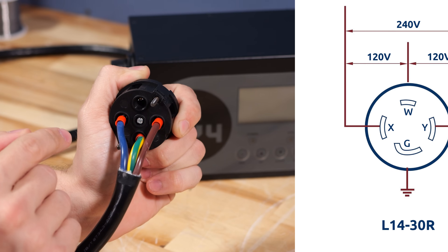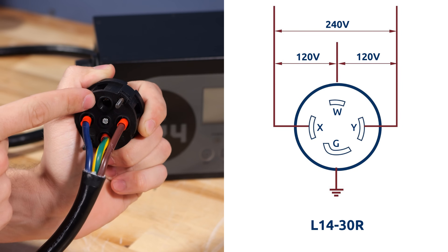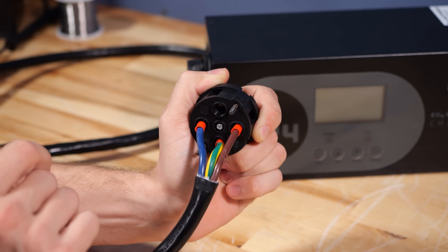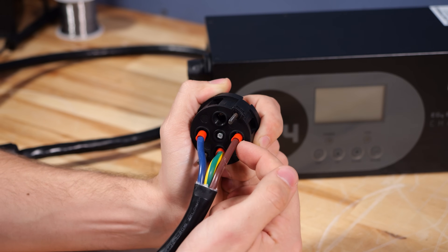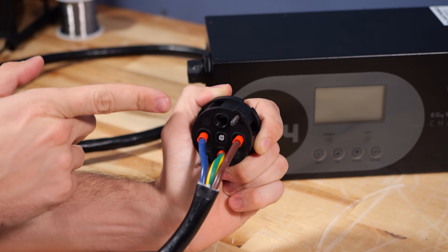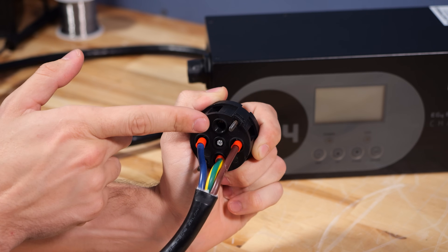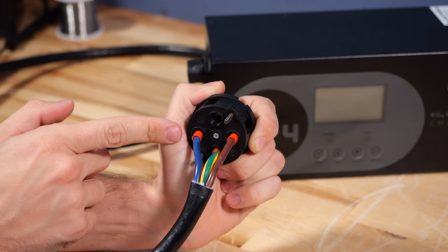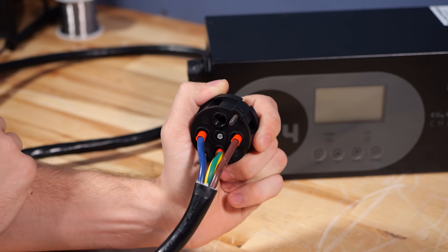When L14-30 outlets are normally used, this would be L1, this would be L2, you'd have your neutral at the top and ground at the bottom. However, this charger doesn't need a neutral — it only connects across two wires. So with the 120-volt cord, it's essentially putting neutral and L1 across those same two pins. This is why there's been so much confusion: when adapters get made, a lot of people wire them correctly and connect the neutral onto the top pin, but the ChargeVerter doesn't use it, so there's not actually a complete circuit. If you were going to rewire this plug for 120 volts, you would essentially have to feed neutral and L1 on the pins that would normally be L1 and L2.